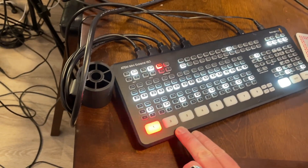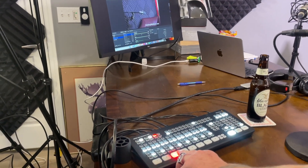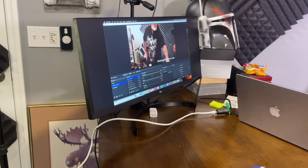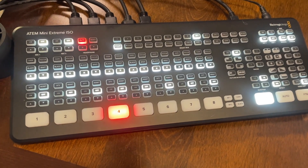I run my cameras through a switcher. We have five cameras running through an ATEM Mini Extreme ISO. The main thing you want to make sure when using a camera for live streaming is that it has clean HDMI — what that means is the time and date stamp and all that stuff is removed from the screen. Do some research on that; it's easy to do on most latest models. Make sure you're buying a camera compatible with live streaming and these switchers. The ATEM Mini Extreme ISO allows you to switch up to eight cameras. They also have the ATEM Mini ISO, which is a four-camera switcher — honestly, that's plenty. I just outgrew it because I had five or six people in my studio.